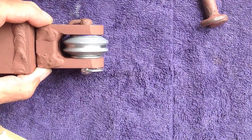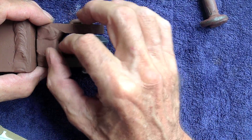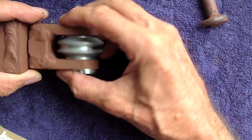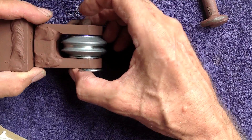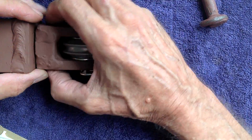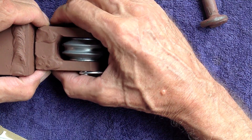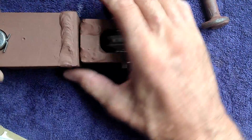What I did is I took a quarter-inch nut and bolt with a couple of washers and clamped them in there because I didn't want to get any welding slag into the threads — at that time I didn't have a tap. So I clamped this thing and then I welded it, which turned out to be a mistake because I clamped it too hard and I compressed the nut. But anyway, that's just part of the story.